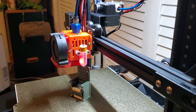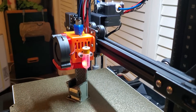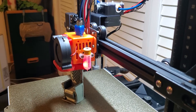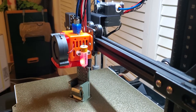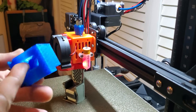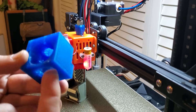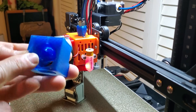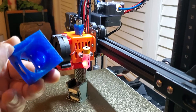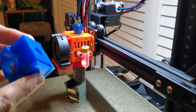I do want to show you some things I had to do to make this work. If you remember from part one, I was showing you the block and some of the pieces from Ray's STL solution for using the stock hot end mount from ArrayOne. To put a Micro Swiss J-head type hot end inside it required a couple of pieces. Most notably was this block, which has the hot end coming up through the bottom, the heat sink going up into the block, with a larger face toward the cooling fan and wire cabling routing channels cut into this block.